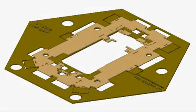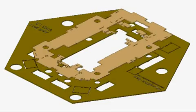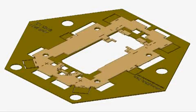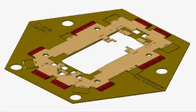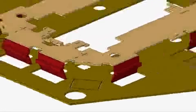The assembly scaffold consists of 2 plates, and separating these plates is the single motion that will fold the monolithic device. To make sure these plates do not tip or tilt, simple linkages are placed on the perimeter, forming what is known as a Sarrus hinge.